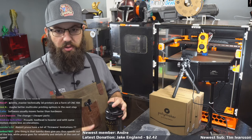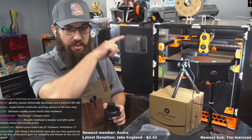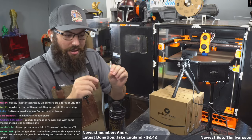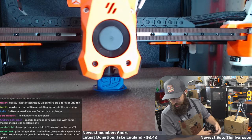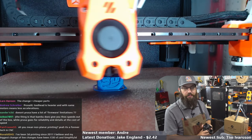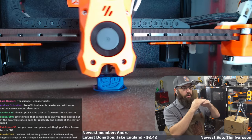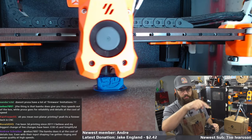It's just that our slicers are so limited that we think, ooh, it does a curve in X, Y, and Z at the same time. It's the same thing CNC has been doing forever. When one little bit comes down to 3D printing, we're all like, oh my God. Yeah, non-planar, that stuff's been around for decades in CNC. We're just limited by laying down layers, so it's X, Y, up a bit, X, Y, up a bit.